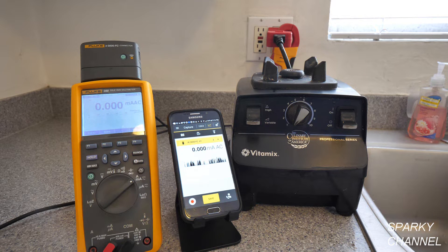You need to know about this amperage in case you're having trouble with a circuit blowing in your kitchen, or you're designing or remodeling a kitchen. You need to know: does this need a dedicated circuit, a dedicated 20-amp circuit? Or can you put other receptacles on the same circuit as your Vitamix, Ninja, or Blendtec?